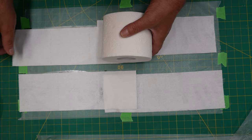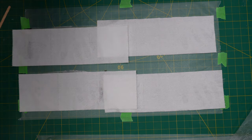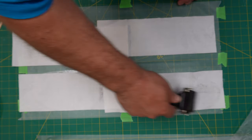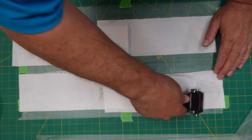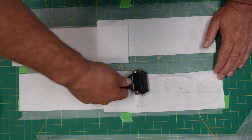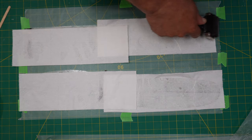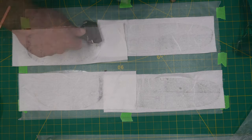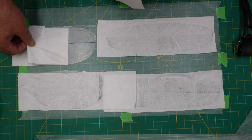We put the toilet paper down and use a hard rubber roller, rolling it all over the toilet paper. It's going to soak up a ton of resin we don't need — it'll leave enough for the job but take a lot off. It's really important that you do this step, and it's also important that you don't wait around too long to take this off.